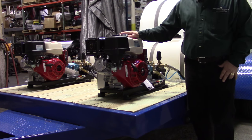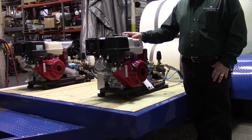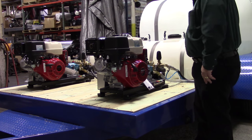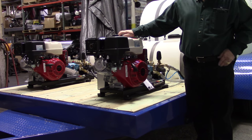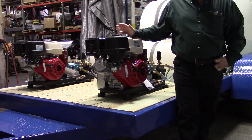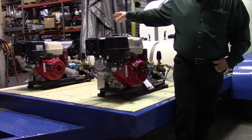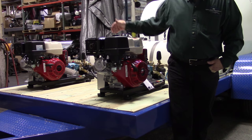This is a training video for one of our clients who purchased this trailer. The trailer is designed for fleet washing. The way we set this up is, this is going to be the number one machine which handles all the low pH acidic soap. The other pressure washer on the other side is the number two machine in a two-step process.